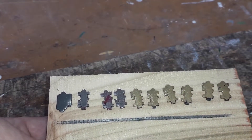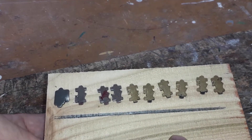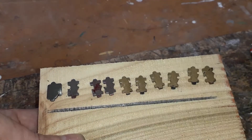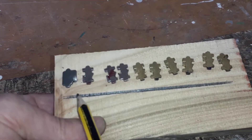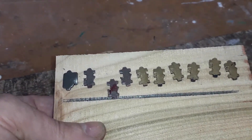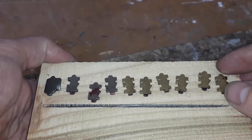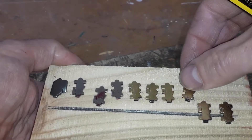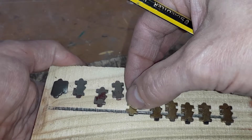Now what we find is that these are all in banks of two. So in a lock you'd have two, two, two, two, two — like this — to resemble this keypad. The idea is that this line is a bar, which is the equivalent of the locking pole, and these pins or wafers would all be in a line lined up like this so the bar is able to pass through them.